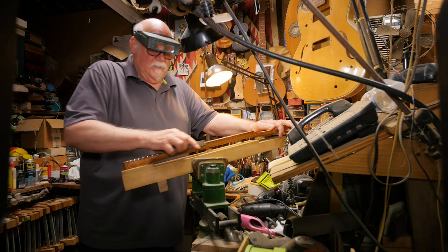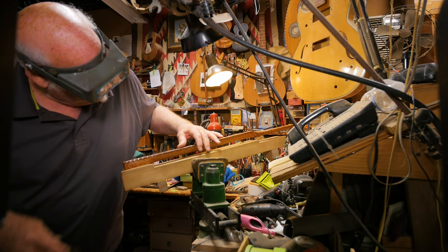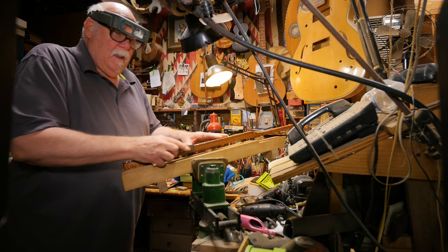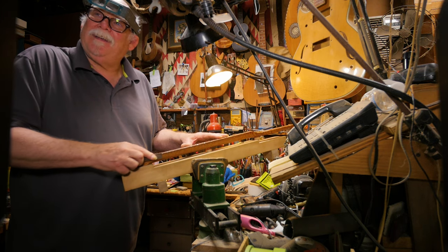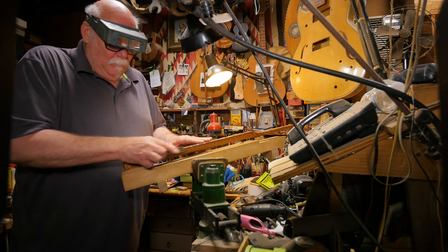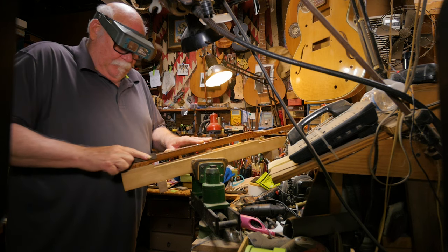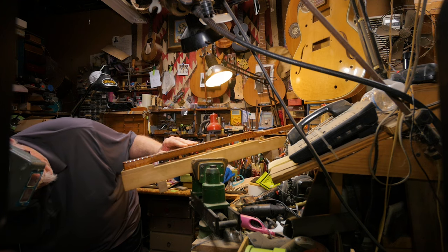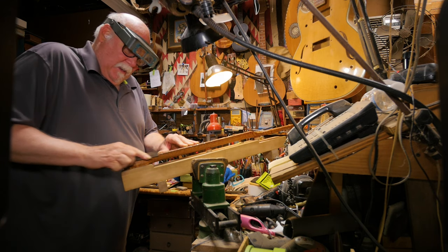And there's finish on this neck, so I go very lightly, but now you hear the difference, hear that? As opposed to that, hear this? I'm on the wood. But remember there's more metal up here because there are so many more frets. So I have to spend a little more time up at this end because I'm filing a lot more metal off up here. And then when I get it feeling a certain way, I come down and I sight the neck to make sure that it's a nice straight run. And I need to take these down at this end still a little bit.